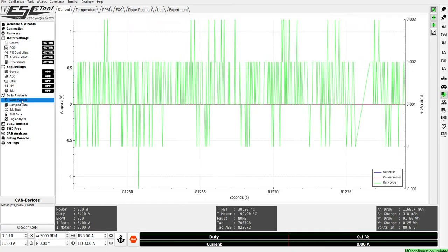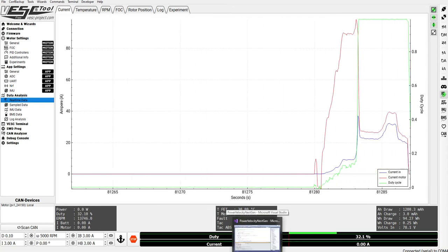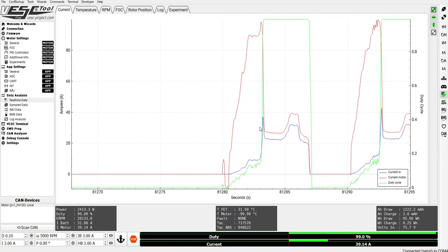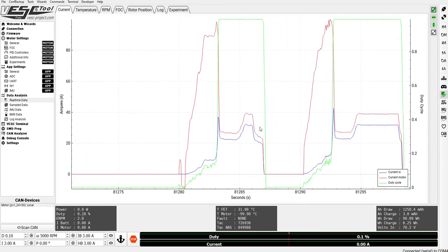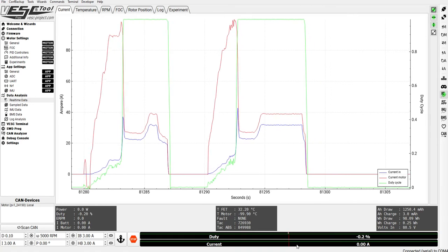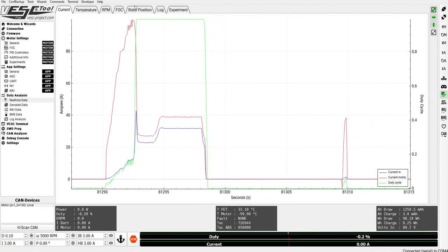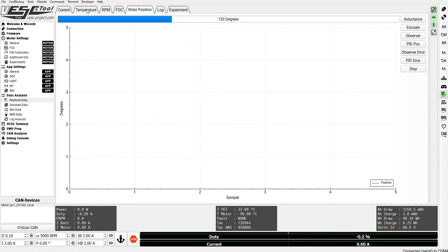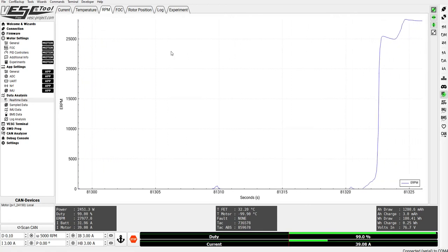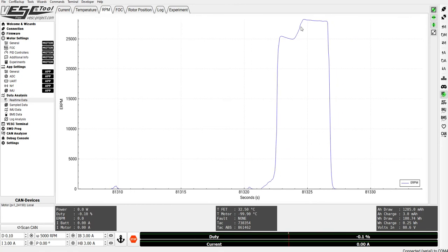With a value of 30, we're now going to spin the motor on the load. Watch what happens — we are getting around 27, almost 28k eRPM. As you can see, if I keep pushing the throttle, the current goes up a little bit but the RPM also goes up. You can see that bump here — that's basically what the MTPA adds.